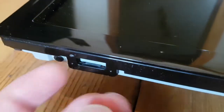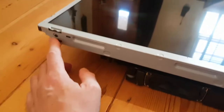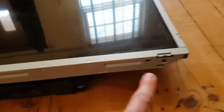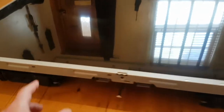Next thing I've got to do is take off the bezel - it's clipped on with plastic clips and it just unclips. Next I've got to take these screws all the way out and take the frame all the way off, all around the side. Take the frame off, then we'll take the panel out - just fold up some boards here and take the panel out.